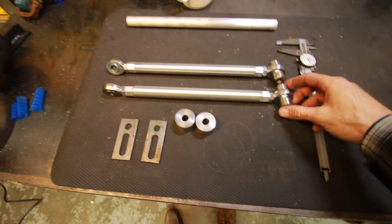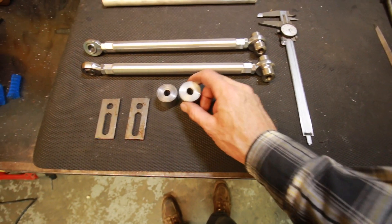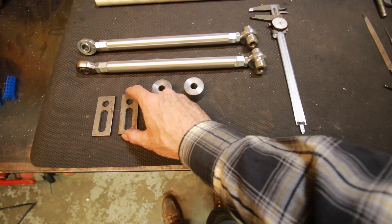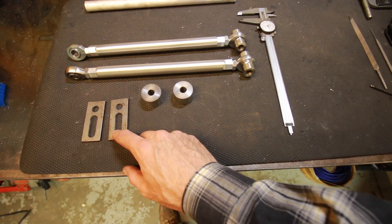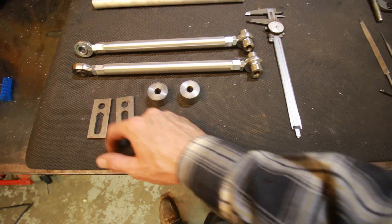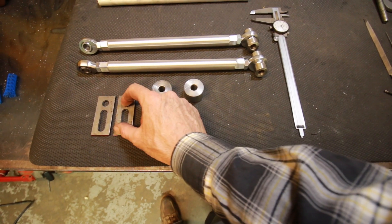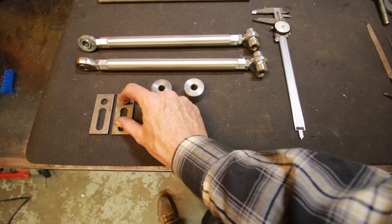Here's the finished product: the tie rod ends with the spacers that go in the body, the spacers that get pressed into the knuckle, and then these brackets which get bolted either side of the spacer to set the bump steer. These are adjustable just for now — completely temporary — which is why I didn't bother cleaning up the corners. They're to measure how much bump steer we have, get it adjusted, and then figure out the actual distance I need to make the real brackets. This is my first real attempt at making a YouTube video, so if you guys could let me know how I did down in the comments, that would be much appreciated. If you want to see the follow-up and see how they go on the car, check out Sarah Antoon's YouTube channel — the link will be down in the description. Thanks guys, I'll catch you later.